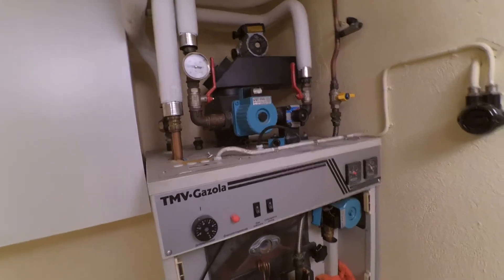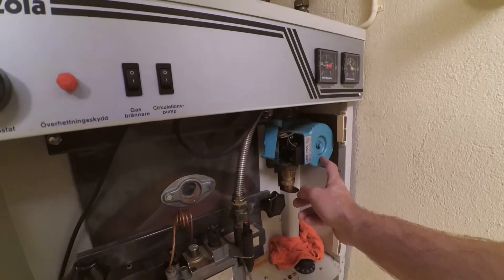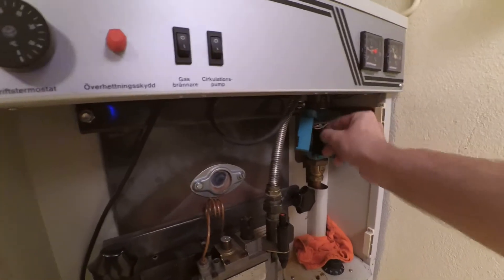Now it has failed me a bit. The internal pump which circulates water from the tank down here through the boiler up here has stuck and burned out — it smells bad and all the power is off.